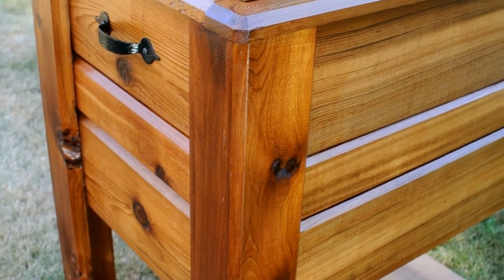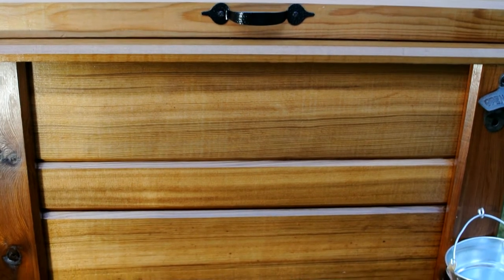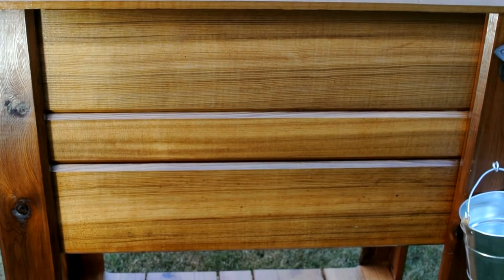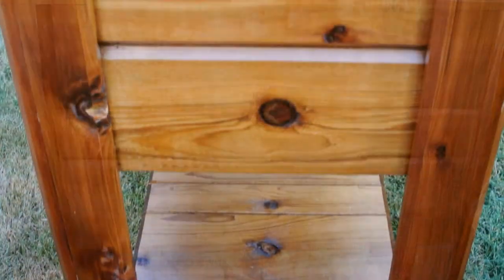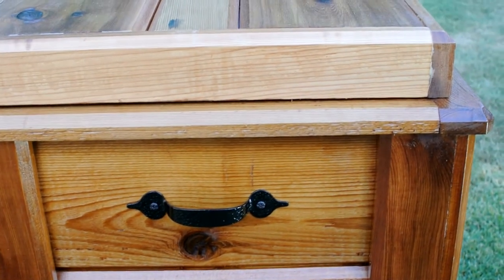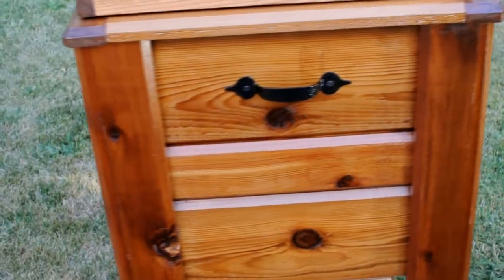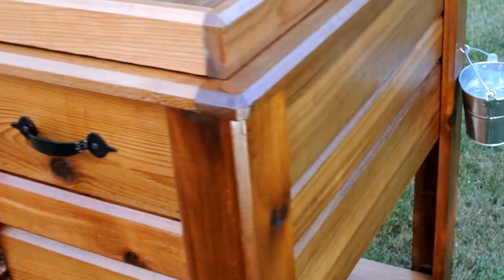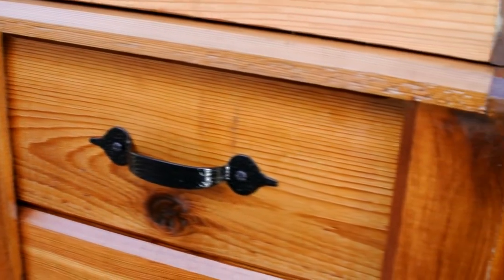For the material I used 1x6 cedar fence boards. I built these panels using two full-width boards for the top and bottom and ripped down another board for the middle. The width of this middle board is dependent on how tall your cooler is. For example, my cooler was 12 and 7/8 inches tall; the total of two boards was 10 and 3/4, so that left the middle board being 2 and 1/8 inches. Next I built the legs by ripping the board down a quarter inch off center, favoring one side. The wider piece is the front of the leg and the shorter piece is the side.